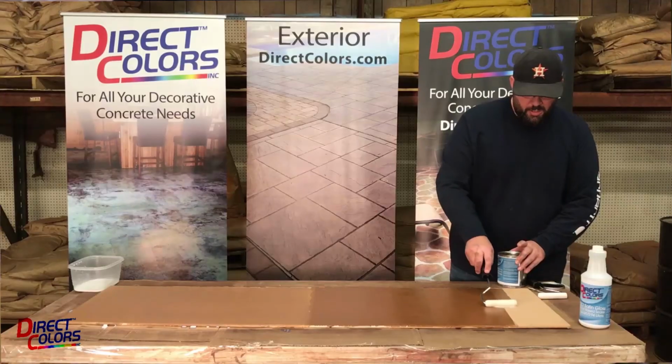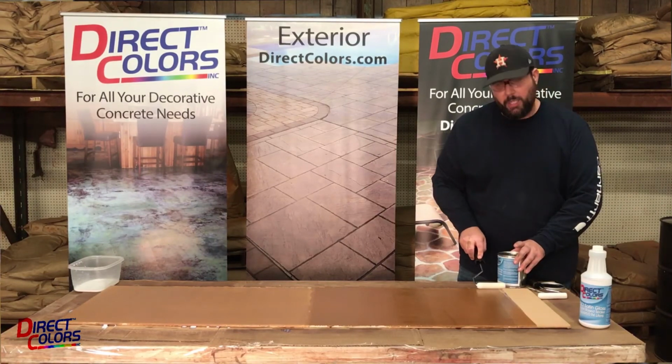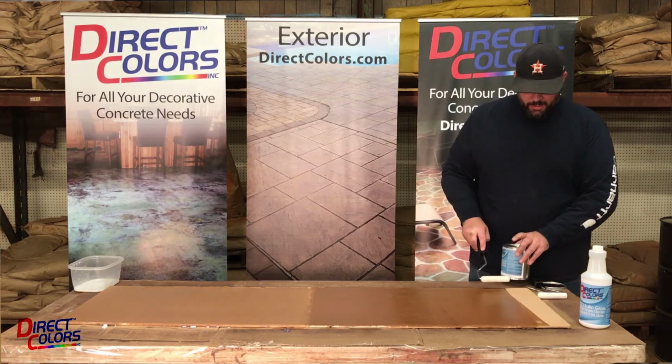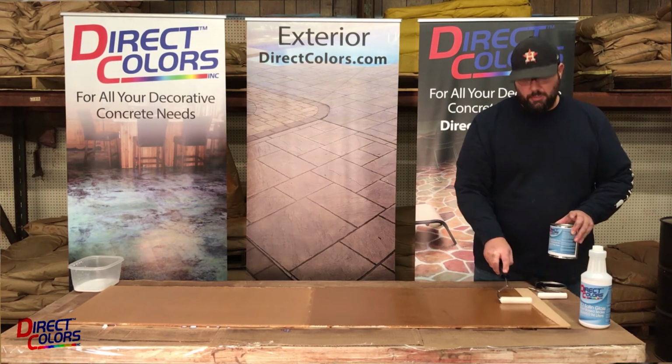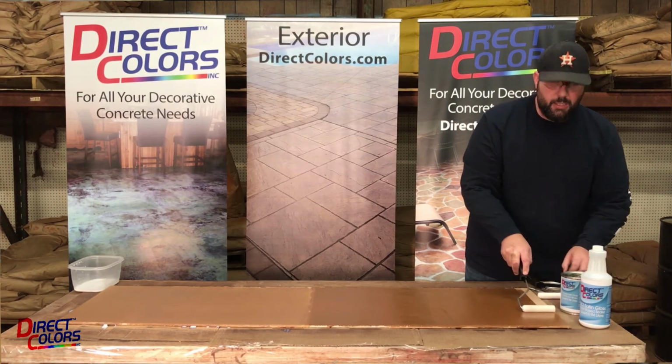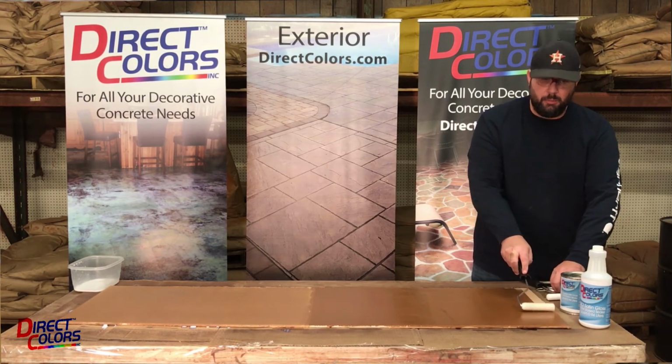Your coverage rate on this sealer is about 200 square feet per gallon. Same thing with the water-based sealer. That does give you roughly enough for 2 coats. Depending on porosity of concrete, the more porous you'll get a little less, the slicker the finish you'll get a little bit more.